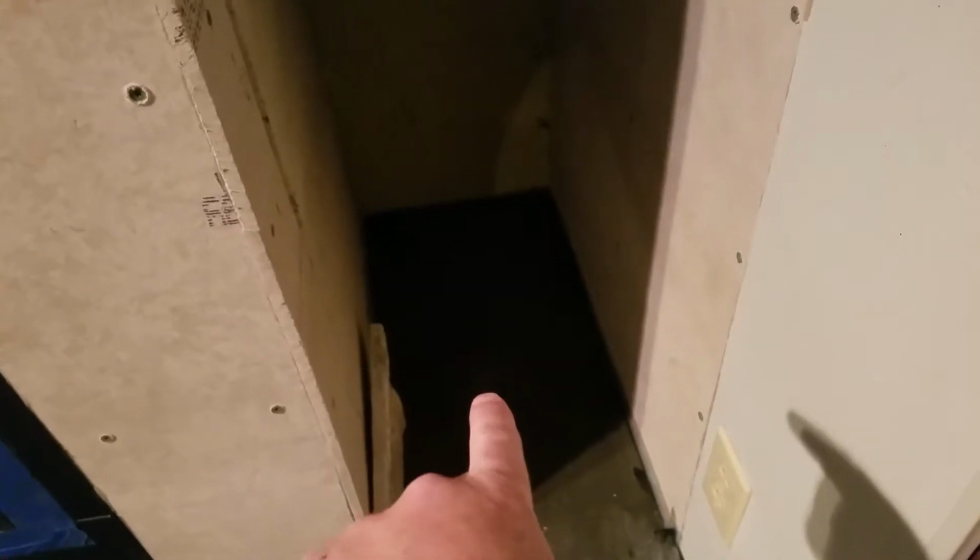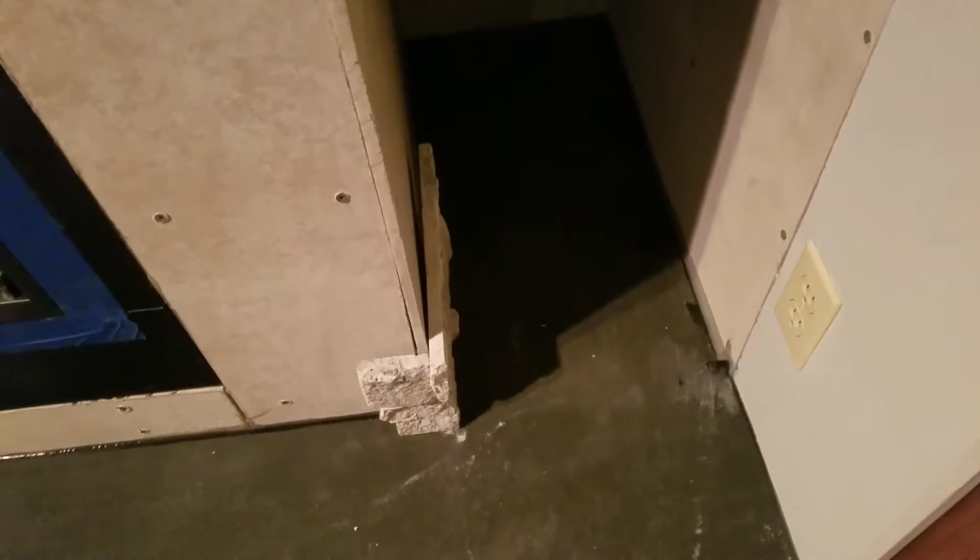And I forgot to mention last time around with the hearth that we put in, we finished off with just sealing that. You can kind of see that shiny piece right there. That is actually just some silicone caulk. So that'll allow it so that any wood that gets thrown in this box, if it's snowy and melts off, they're not going to have any issues with water getting down below the hearth and rotting the subfloor. So we sealed that all the way around here just to make sure there were no issues with that.